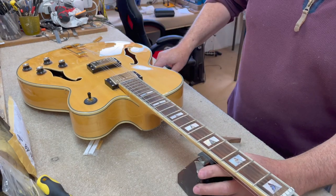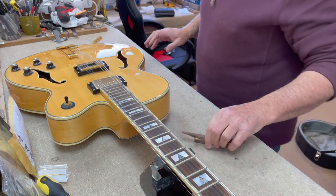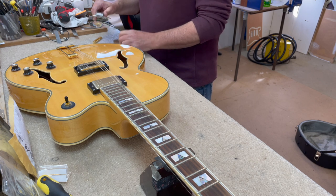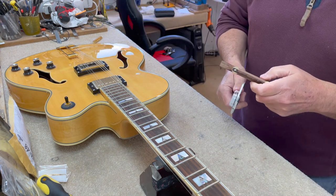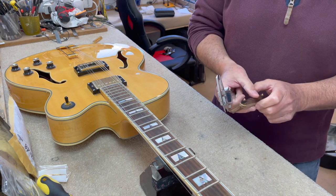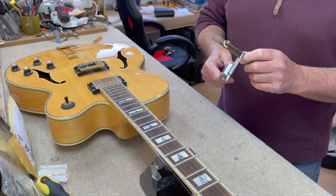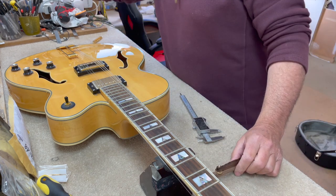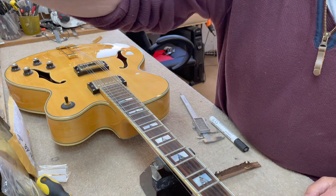Okay, my first observation, I'll say straight away, is that these two components together go even taller, I think, than we've currently got. So let's make a measurement, first of all, of this one. Which side are we? That's the compensated side. Let's do the G. The G is our measuring point. So the G is 20.38. I think I need to remove these old measurements on here. 20.38.